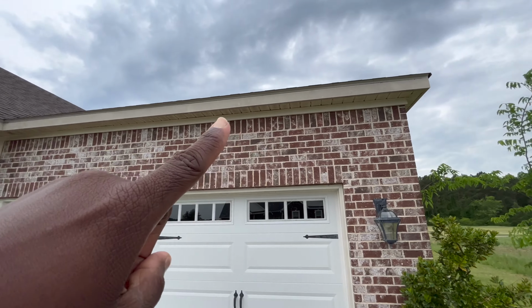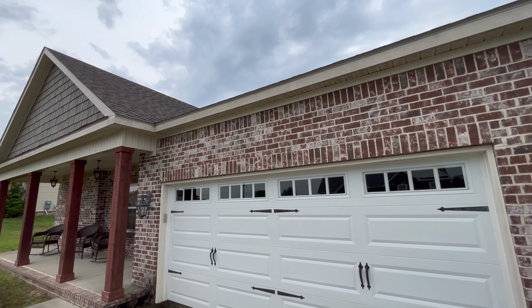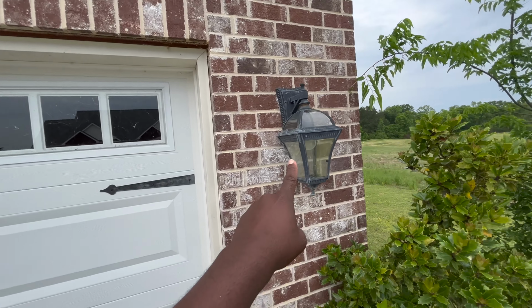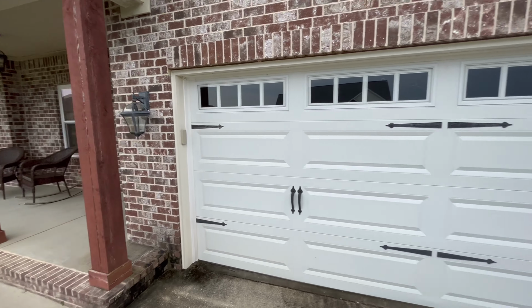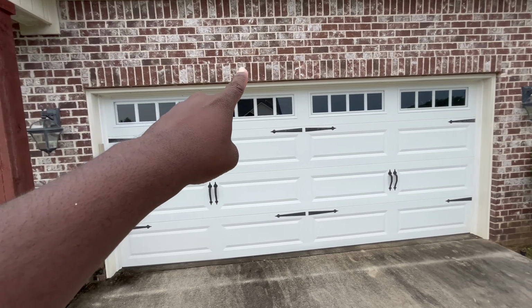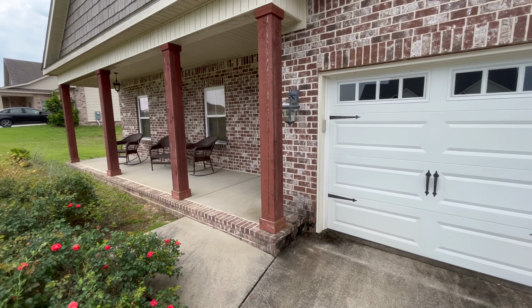When it comes to all that up there, just your downstream mix, or if you're gonna soft wash, your regular household mix would be great there. But I would definitely put a bag over this. Same thing with that, put a bag over that. Now, I did make a video about this earlier. The brick, I would wet first before I put my mix on there. Why? I don't want it to dry and dry up white.